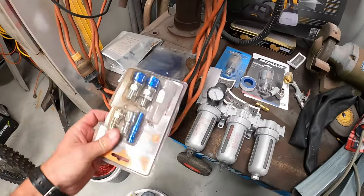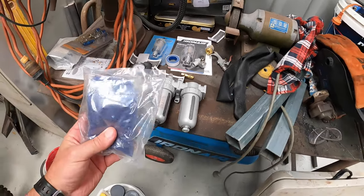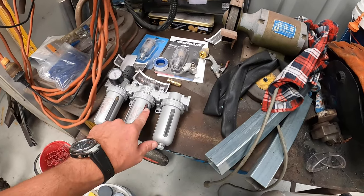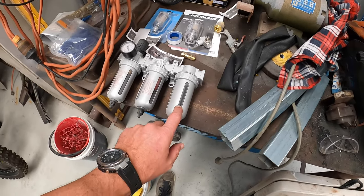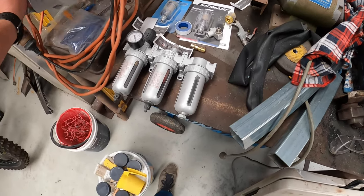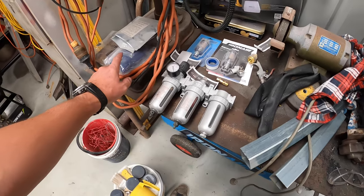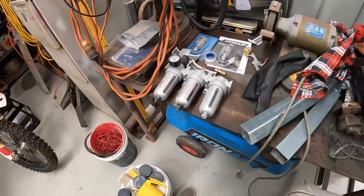This water separator is quite good — this is silica gel. You fill one of these up with silica gel and it basically changes colour when it picks up all the moisture. The good thing about it is once it's wet and picked up all the moisture in the lines, you can bake it in the oven and it comes up like new again. Pretty good thing.